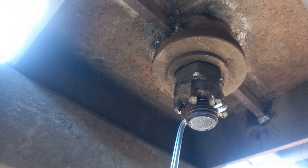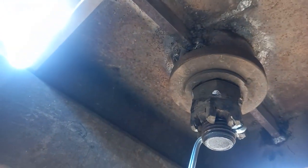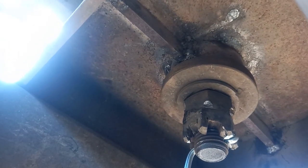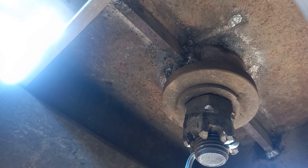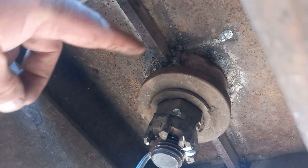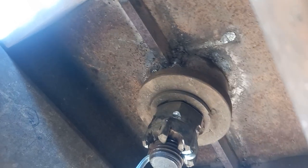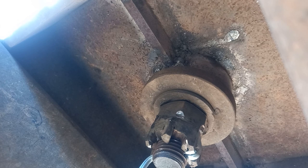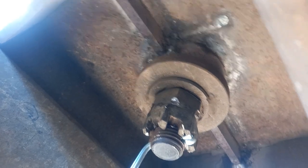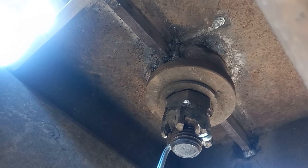One of my mates, Benny, when I first built this thing made the comment that he felt it could lead to a problem — and yes it has. But the whole structure was still very much intact. I just wasn't happy with the cracks I saw. The one down at the bottom edge was only a very hairline crack and I couldn't even see it on the other side, but we ground it out and welded it in just to make sure.